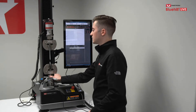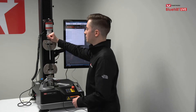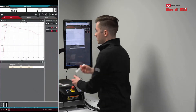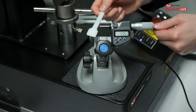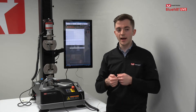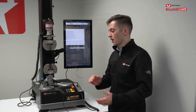Once you have run one specimen and want to run a second, the rest is straightforward. Remove the first specimen, take your second specimen, run it through the micrometer to take measurements, and you're good to go. It's a streamlined way to measure specimens rather than using a handheld caliper, where you can get more user error than with the micrometer.